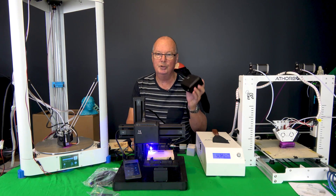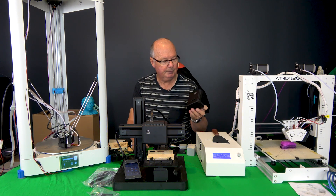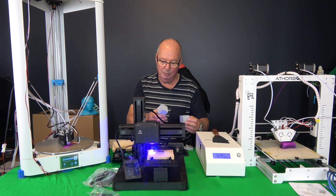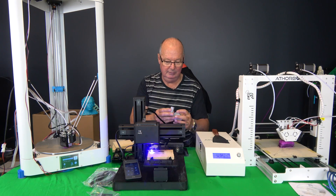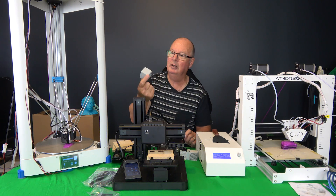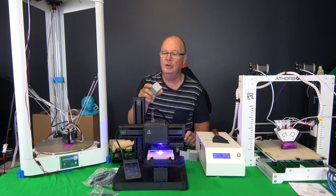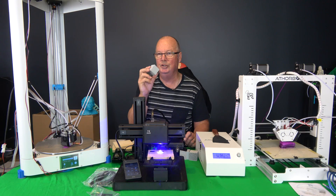I have asked Moose to send me either a replacement head or a replacement board so I can get it running again, but I'm still waiting to hear back. About 90% of the problem was caused by me, but a filament jam is something that can happen to anybody, and to fix it in this machine — yeah, just don't go there. I did manage to get a couple of prints. This is a 40mm cube — that one is complete. This is the only completed print I got before I killed it. I've put it under the calipers: it is 39.95 by 40.05mm, which is damned accurate.